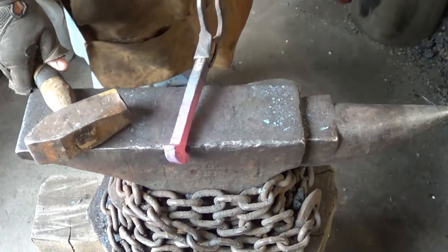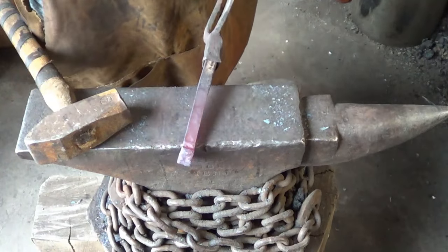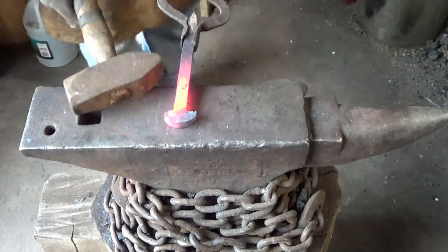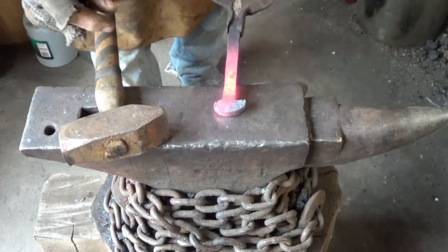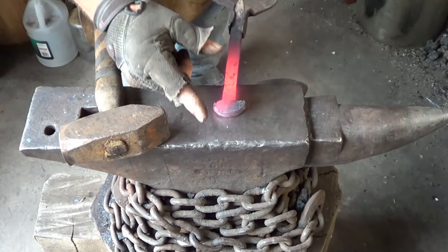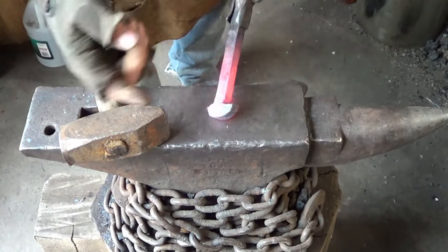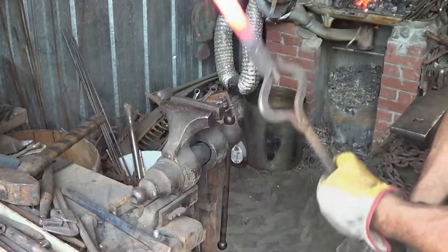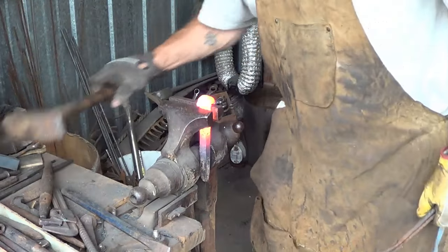All right, let's go back to this head - it looks a little different than normal but we'll drop a little more of a nose and go back to work. I don't need much more steel. Cool the horns back down again, drop that nose. When we get down we'll be okay because that part there we're going to squeeze down using the vise - I'll show you that in a second. We're going to consolidate this this way. I'm not happy with it - my horns are rolled a little, my nose has got a wacky little fold in there. Next step: put a decent heat on, put it in the vise so it lays flat, just snug, not super tight.